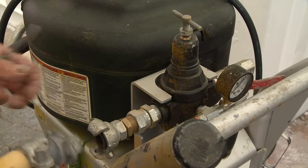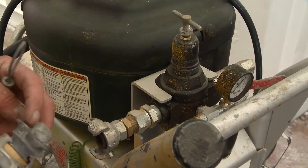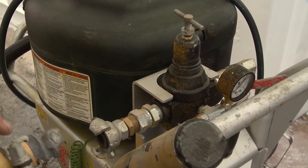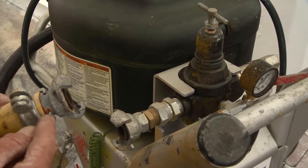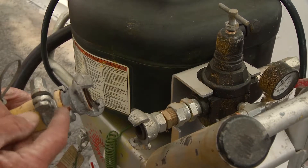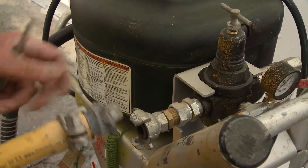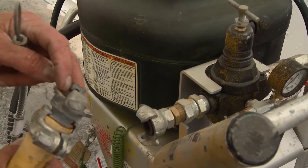The air supply for this particular unit requires that the gaskets are in good repair and the clasp is not damaged. Also the retainer on the double bolt clamp — the two retainers have to catch the edge of the fitting itself, and that is the stem of the ferrule that goes down inside the hose. Ensure that all of this is tight and the gasket is in good repair.